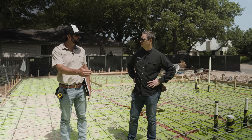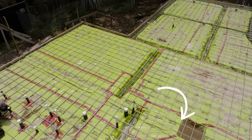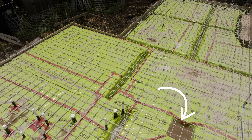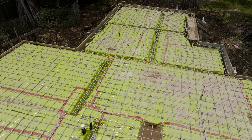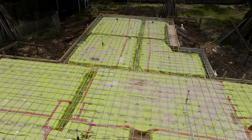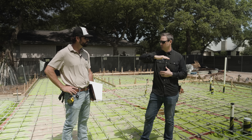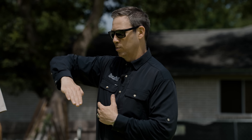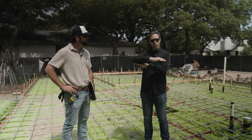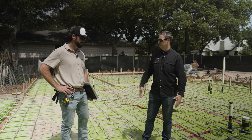This is just carrying an interior load-bearing wall on that existing foundation because we didn't have a beam where we needed one. It's spreading that load out — those are point loads coming down onto the foundation. When I think of foundations, I remember your dad explained this to me years ago: this foundation is like a big battleship on the water. A battleship doesn't break in half because it's really stiff. If we had bad soil, expansive clay or other issues, we're designing that house to be a battleship — the whole house moves as one stiffened slab.